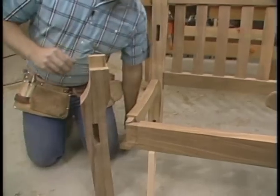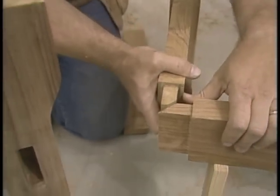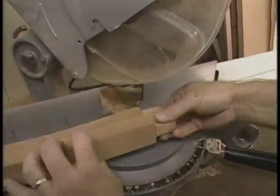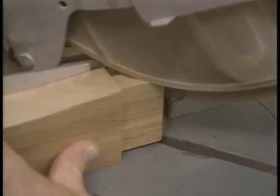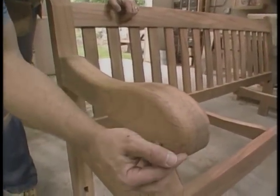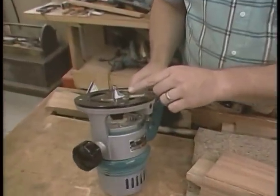Let's look back at our prototype again. In some cases where the mortises are at the same height, they intersect one another, and the tenons would hit each other unless I mitered them in the corners, like this. So I'm going to use my power miter box to make that cut. I want to round over the top edge of this armrest so that it isn't sharp. I'll go along the top and come around and stop right about here because I don't want to go where my joint is. To round that over, I'll simply use my router set up with a half-inch rounding-over bit.